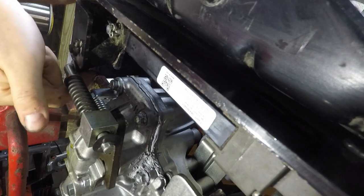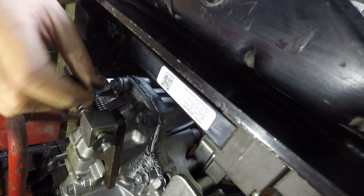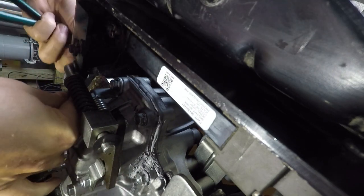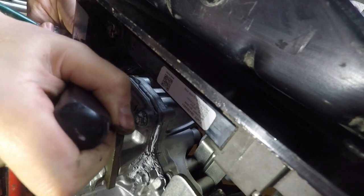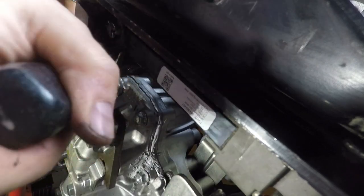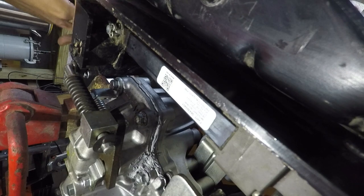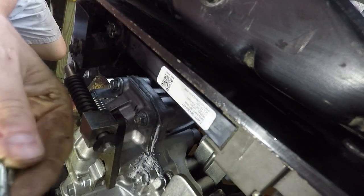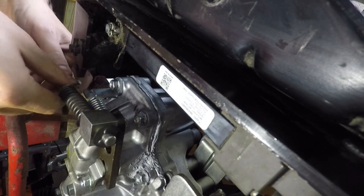This mower has this section on it because it has an electronic locking differential. There's a cylinder here and it actuates — it slides over and locks both wheels. So yours may or may not have this. There's a little clip on here. I came over here and just pulled it real hard and it must push these out, then this will come off like this. So that's loose now.